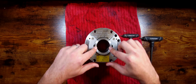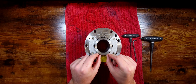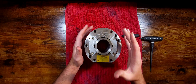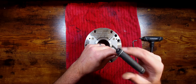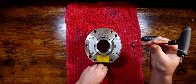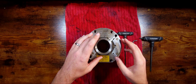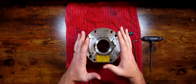Whenever you go to do this repair, this ring is the actual ring that seats down against the shaft. Each of these little allen heads — and there are six of them in total; the older ones had four but the new ones have a six arrangement — all need to be tightened down nice and even with your new one. Taking it apart is not that big a deal. They have these little clamps, and how these work is you just pop these off and they sit over to the side. When you first open it up on a system that's in operation, you're going to see that these little clamps are sitting off to the side. If you do not see them in place like this, I do recommend you definitely want to find them. There is a series of different mechanisms and springs in here, and these are really beneficial in helping you keep alignment.